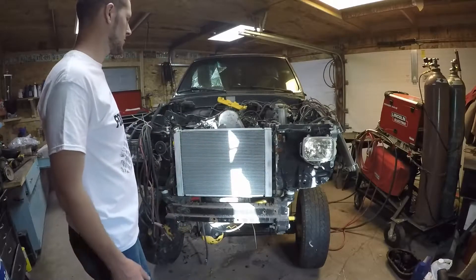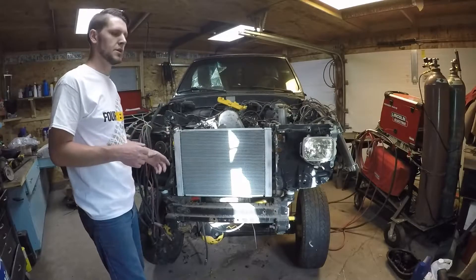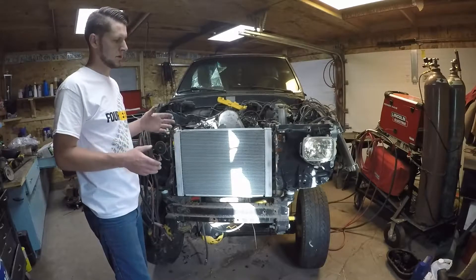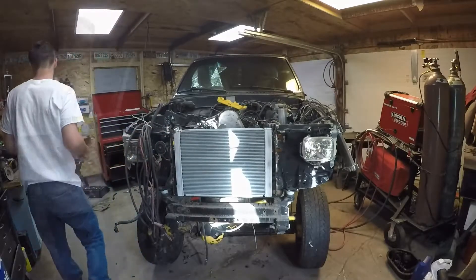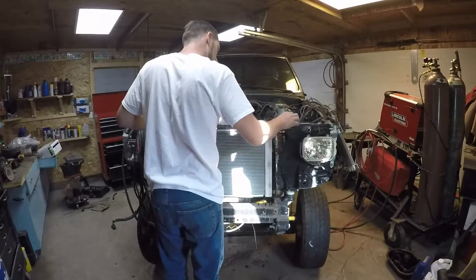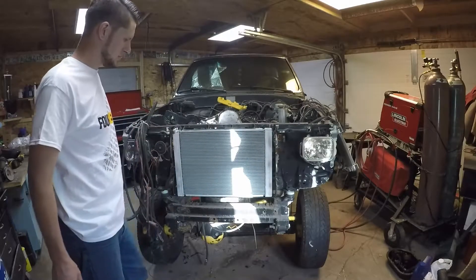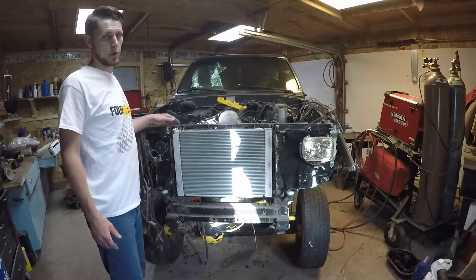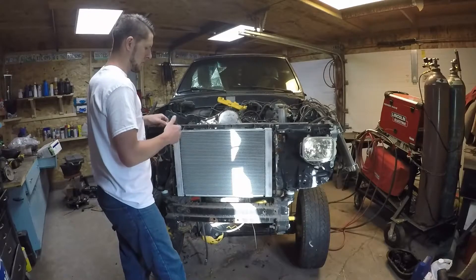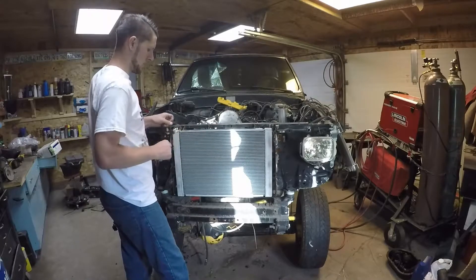You can see roughly what that's going to look like. The next step is going to be to get our radiator hoses out, get those mounted onto the engine and to the radiator, and see exactly where those hoses are going to want to push our radiator side to side. The last step is going to be to mount the bolt-on bracket from the top just to verify that we're within our parameters from side to side. Right here I'm about maxed out as far as I can shove my radiator towards the driver's side, otherwise my bracket would actually start interfering with my radiator.